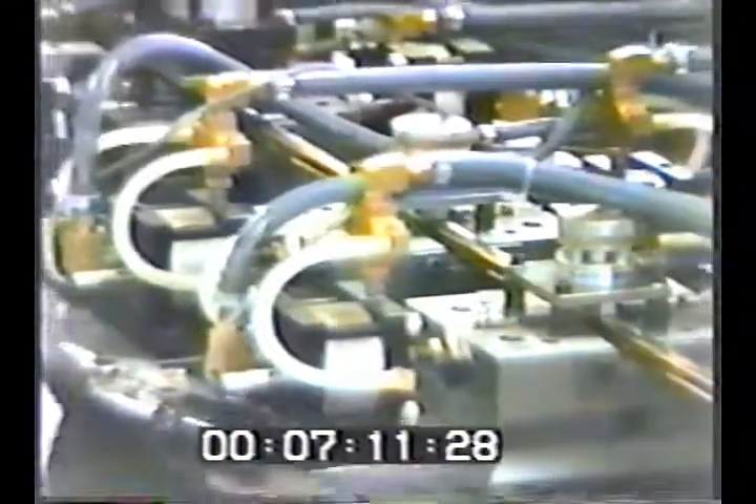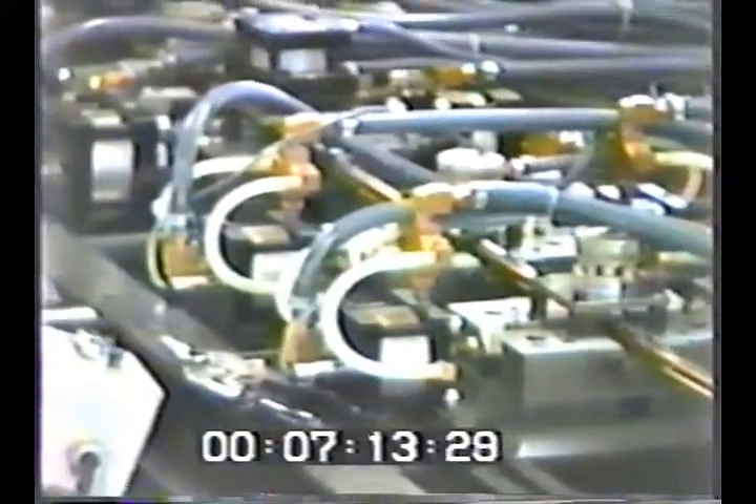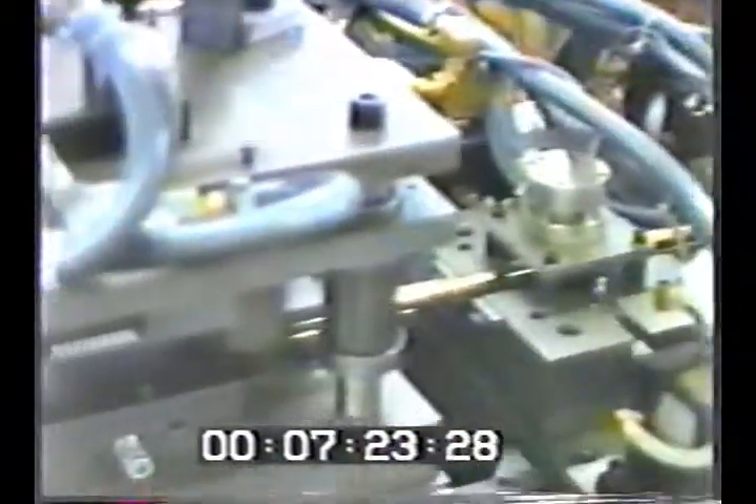There are 14 different setups to produce frames, ranging from 2½ by 3½ inches to 11 by 14 inches. The cope and cut-off die will cope out the back-bottom leg and cut the part to length while forming a lock tab on the end.